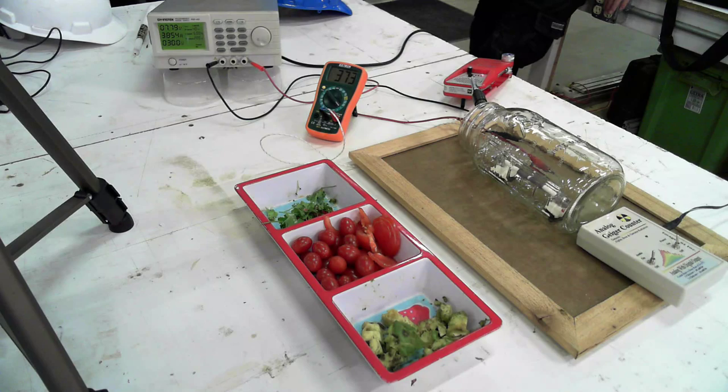And if you put too much material in there, i.e. you don't leave enough space for expansion of the gases, you could end up with extremely high pressures, and one of these devices completely fracturing. So there's a little bit of genius in the simplicity of what Parkhomov got there, because he's effectively looking for leaks, but also providing some level of protection.